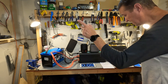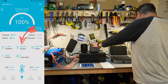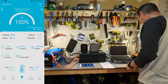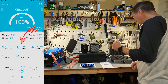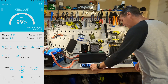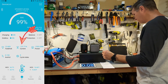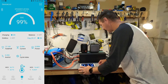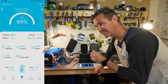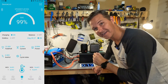Let's turn on the inverter. We'll pull up the app on screen and turn on the 500 watt heater first — you can see it's pulling about 40 amps. Then we set the NuWave to 600 watts, and now the current is 93 amps. We then turned on the 200 watt heater to push it up to around 111 amps — and the battery shut off. It shut off after running at 120 amps, so this battery doesn't have much of a ceiling above 100 amps and it's not going to allow it.